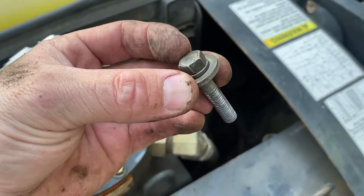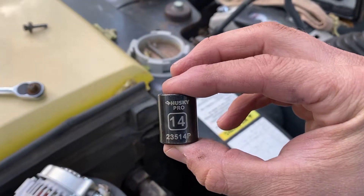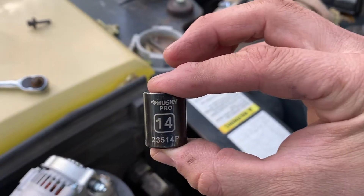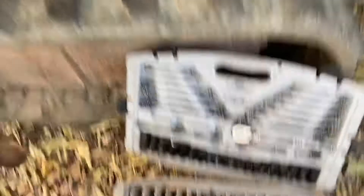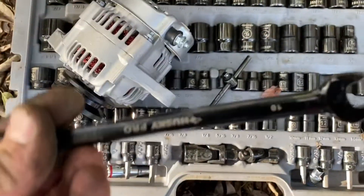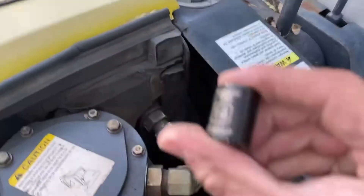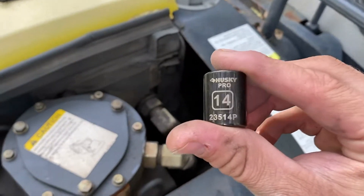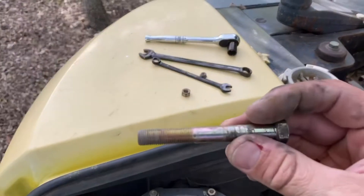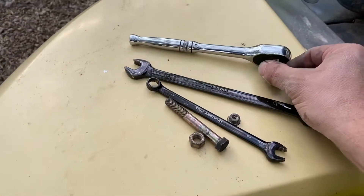Here's the top 12 millimeter bolt with a couple of washers. The bottom bolt is different — it is 14 millimeter. So your top one is a 12 and your bottom bolt is a 14. The nut on the bottom of this part on my machine was a 10 millimeter. Komatsu put a nut on the back but not on the top one. The bottom bolt needs 14 millimeter on both sides, and the top one just needs the 12 millimeter. The 10 millimeter goes on the electrical connection.